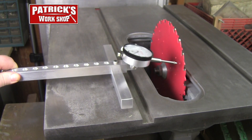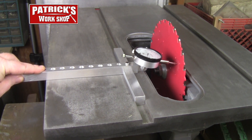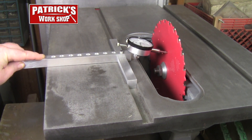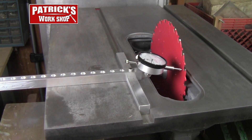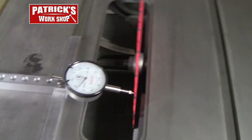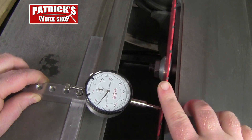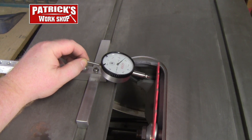This thing went together exactly how I planned it in my SketchUp model. Here it is — I'm putting it into the miter slot on my saw so you can see what it's for. You slide it back and forth to check the alignment of the blade; the blade should be perfectly aligned with the miter slots. That'll be for another day — I will show you how to do that exactly, step by step, in the next video. Stay tuned for that.